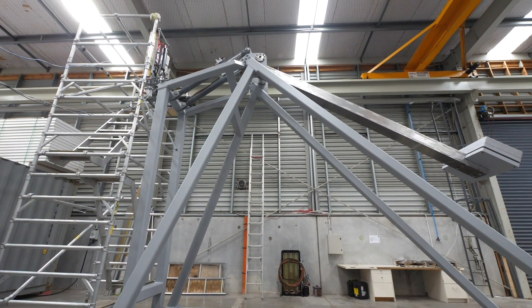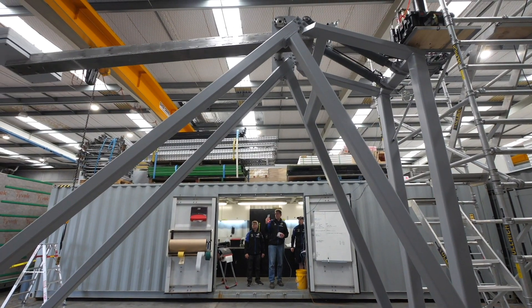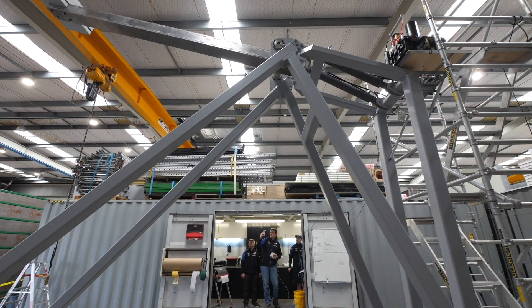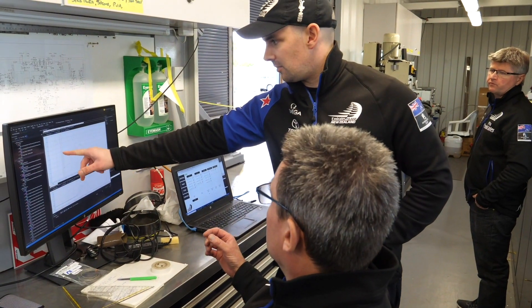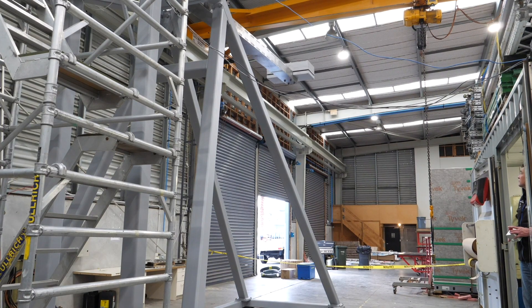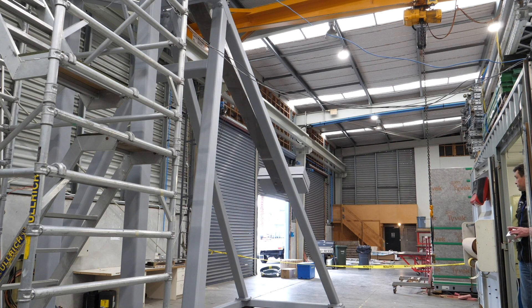The arm in the position it's at now is at 70 degrees, which is basically when the boat will start to sail and start to foil. From there, the windward foil will be raised out of the water to an angle of 120 degrees, hopefully achieved over three seconds. There is still some oscillation, but through the logic and trimming of the hydraulic system we can alleviate that bounce at the end.